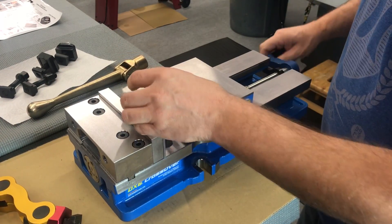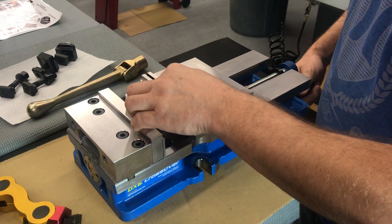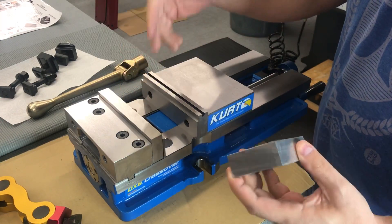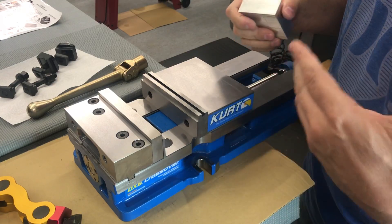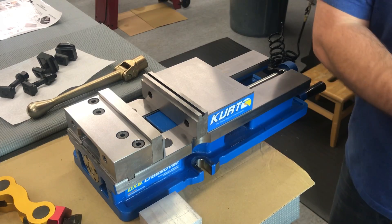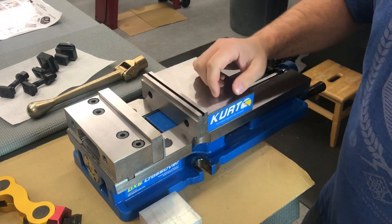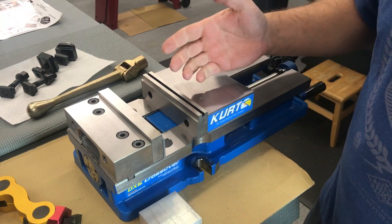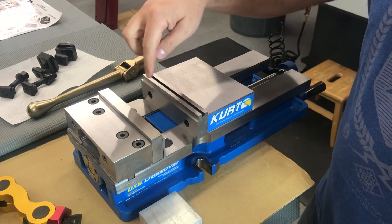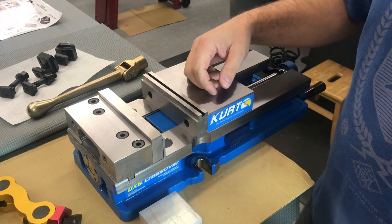And that's all well and good, but one of the things you'll find is that sometimes when you're taking something out of the vise or when you're using compressed air, your parallel will actually flop down — and who knows, it may pick up chips or whatever. It's just another time waster. I've been watching one of the Haas videos, and there are a variety of different methods and companies that sell parallel keepers. One guy in my YouTube comments suggested using the metal banding from one of your crates, bending it into an S shape so it holds the parallel — it becomes its own parallel keeper and it's obviously free.